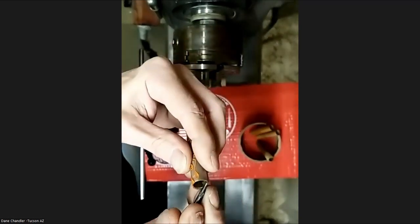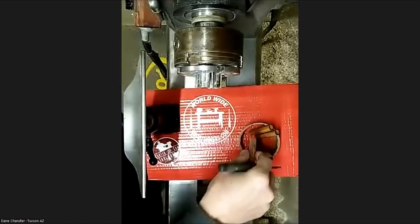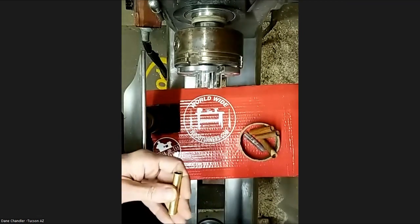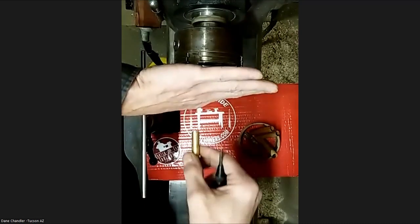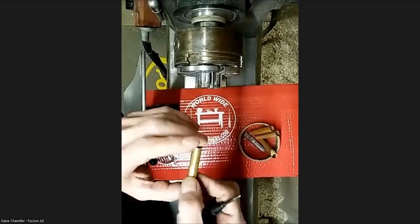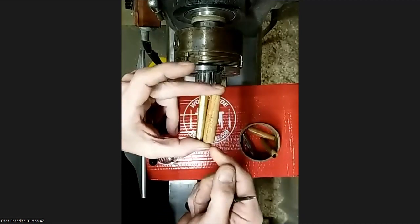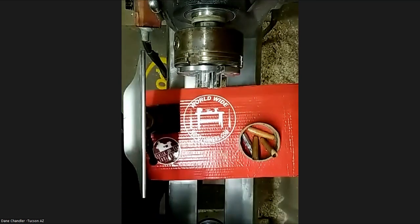And I'm also going to show how you don't need a barrel trimmer or a jig that you set up on top of your tailstock to go into a sanding disc to trim and flush your blank. All you've got to do is use your skew to flush each side. So we're going to try and demonstrate that tonight.